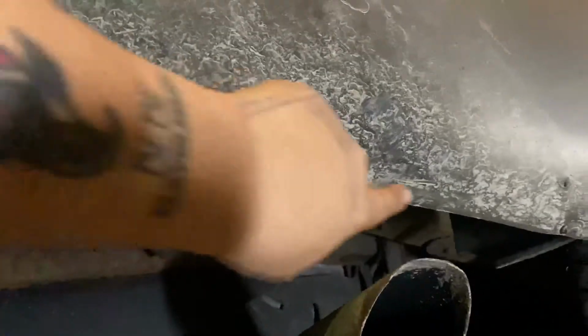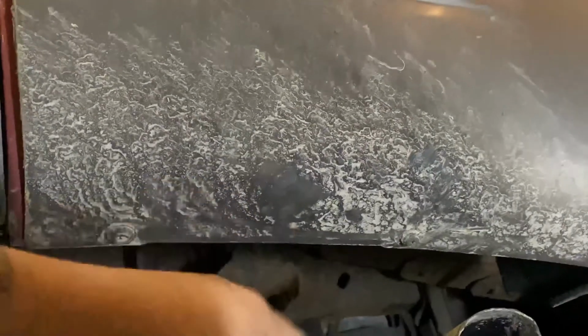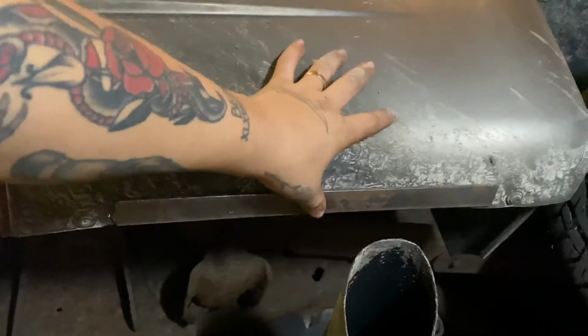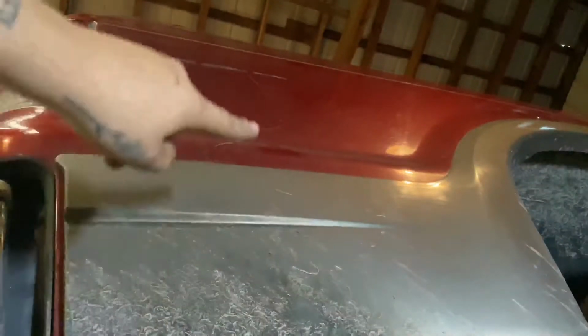The first thing I'm starting with is the ladder, so I'm gonna get my steel ready. This piece right here is gonna go mounted onto this piece here. This piece right here is plastic, but on the inside we have metal. I'm gonna have it centered in between this screw and that screw right there. And we have 14 inches right there across. That'll be the same width of the ladder going all the way up to the top.